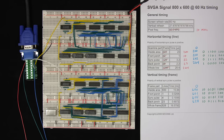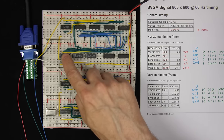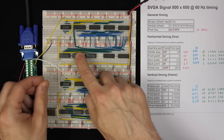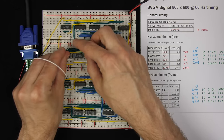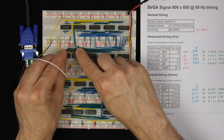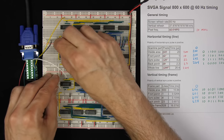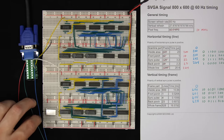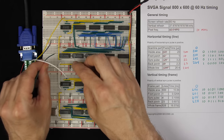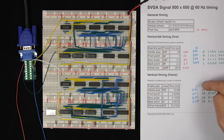The red, green, and blue signals tell the monitor what color pixel we want at each location. Since we're synchronized, we know exactly what pixel the monitor is painting. For example, if I take just one bit from the vertical counter — say the sixteens-place bit — as we count from 0 to 600 down the screen, that bit flips on or off every 16 scan lines.